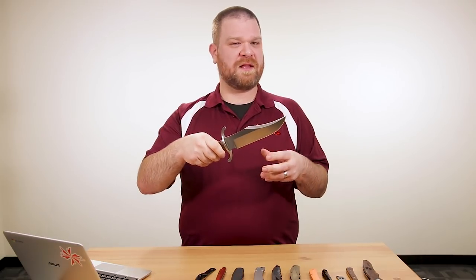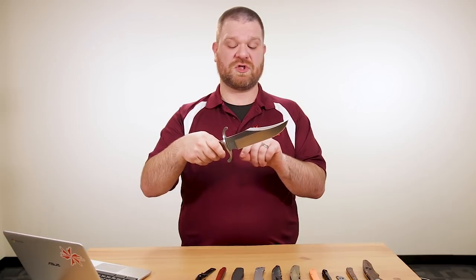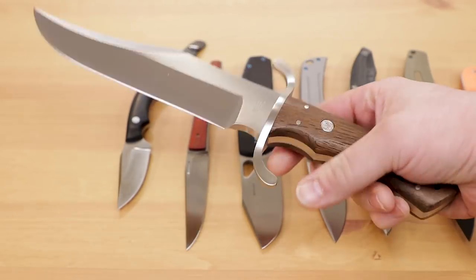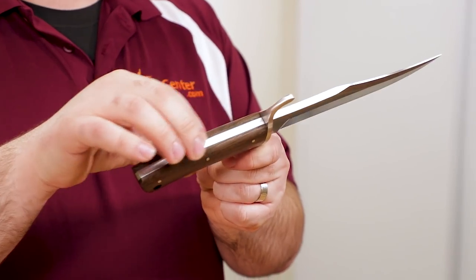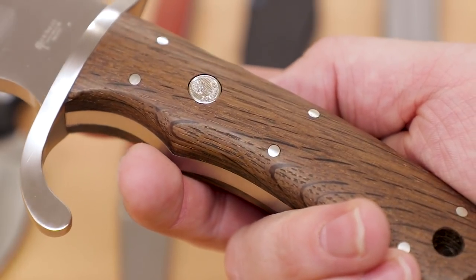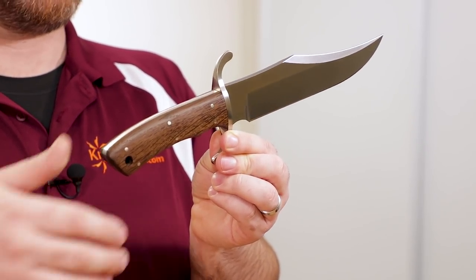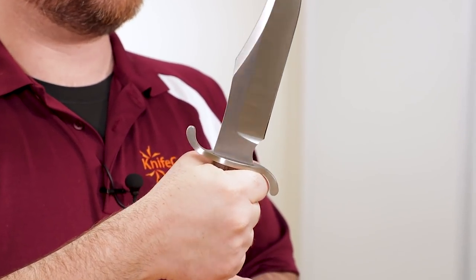Being a Bowie knife, one of the old school accepted purposes of that area — even if it's not rounded like a choil — is they'll often leave a little unsharpened spot at the ricasso. If you've actually stabbed this into a target and need to remove it, you can get your finger in front of the guard for more leverage to pull it out. The steel is about a quarter inch thick with N690 giving decent toughness and good stainless qualities. It's got a full tang going out the back, not tapered, with oak handles.